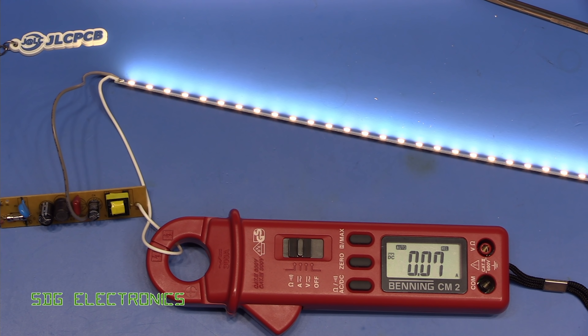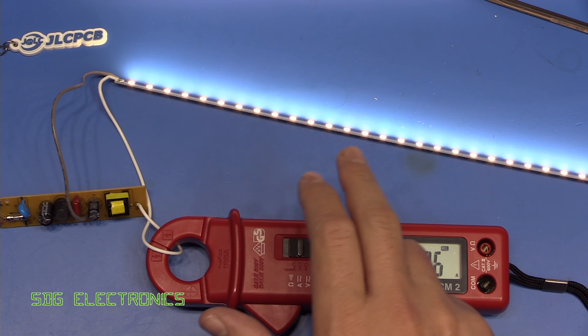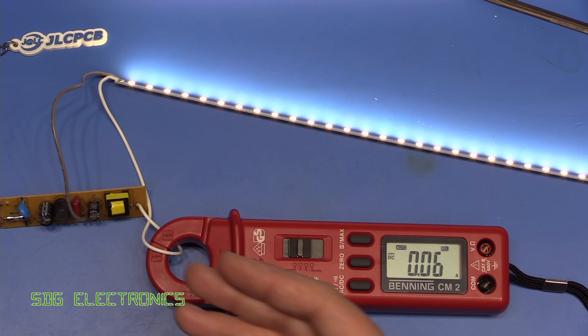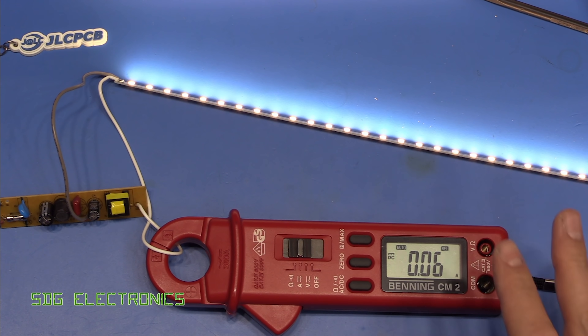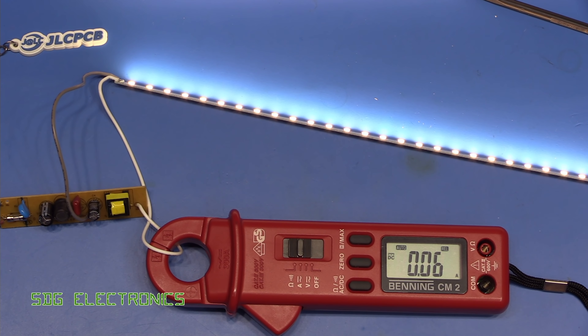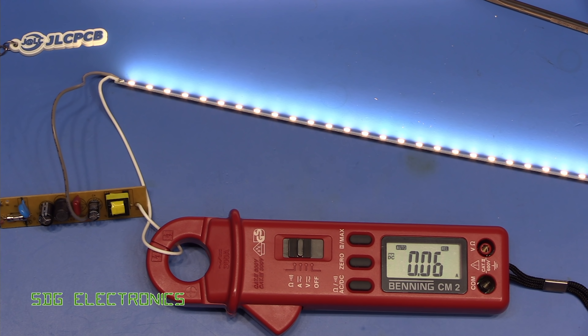All the other LEDs are lit, so it was just that one faulty LED — which is a bit of a surprise. I really wasn't expecting a failure on any of these LEDs; I thought it'd be the driver. Typically what you tend to see on these LED products is that the LED driver lets them down — normally the electrolytic capacitor or something like that. In this case, that wasn't it. I don't think the location of the faulty LED being right at the end holds any significance — the end where the LED was damaged is actually furthest away from the heat source, the LED driver. It's a series circuit, so that one isn't going to see anything different to the rest. If you've got any thoughts or comments, leave them in the comments section below. Don't forget to visit my video sponsor JLCPCB if you're thinking about getting some PCBs made. Until next time, thanks for watching.